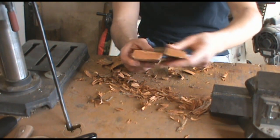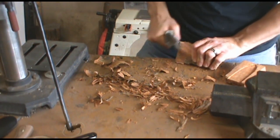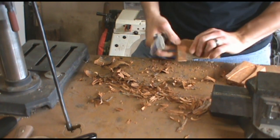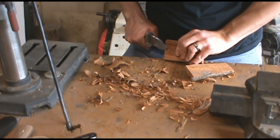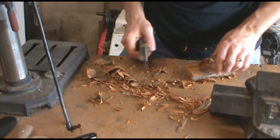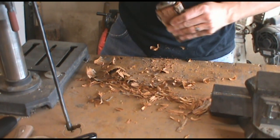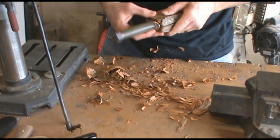We'll take and trim this raised part down until we get a nice friction fit on both pieces when the knife slides in. You want it just to where it will barely hold, because you're going to tighten it with paracord or natural cordage. So that's a pretty good fit — I may go just a hair more. Got a little bit of a chamfer here so the knife is a little easier to get started. Alright, let's see what that does. Should be good to go.